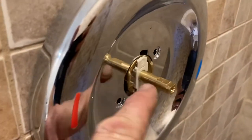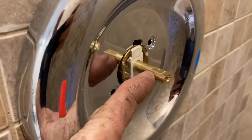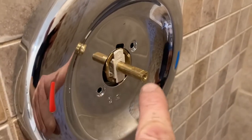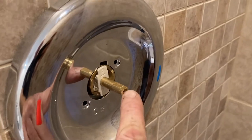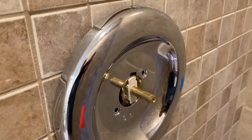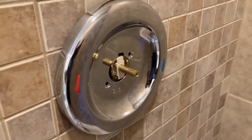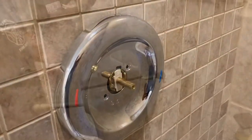What I'm going to do is pull the cartridge, take a half inch off the shaft, re-file the flats back into it, drill it, re-tap it, and see how it works. At worst case I'm only out the cartridge, but if it works it's going to look a lot better.